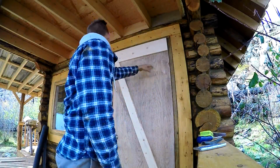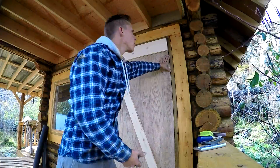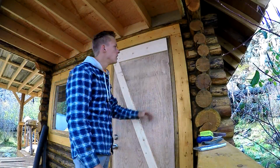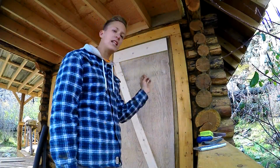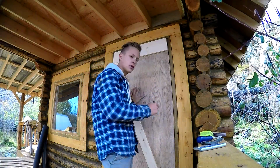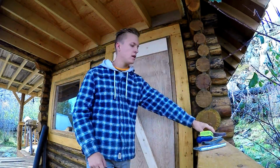There's a bit of resistance right now just because the door or the frame might be a little warped. It's not much, but when I get the hinges on and this thing latches, it'll be no problem. So I'm gonna lay these out the same on door and jamb. Again, I'm gonna maybe leave it away from my actual door stop on the inside, maybe just a 1/16, because that's where I'm gonna put my weather stripping,